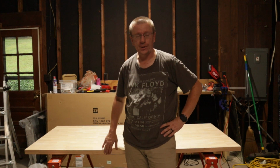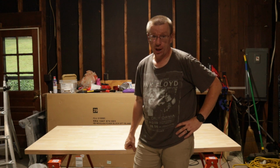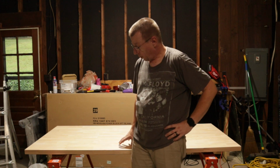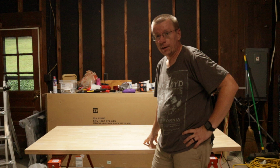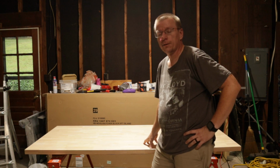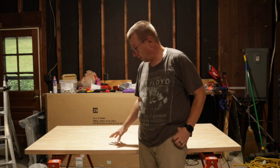I think it was just too hot and humid for that finish, so it's extremely blotchy and just turned out overall terrible. So I picked up some normal dark walnut stain, and the triple thick polyurethane coating. So I'm going to do it in a two-step, but I'm still going to go through.